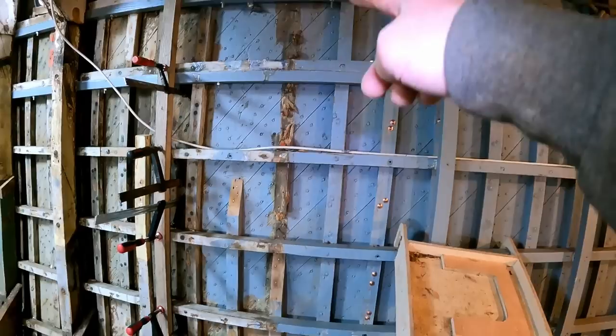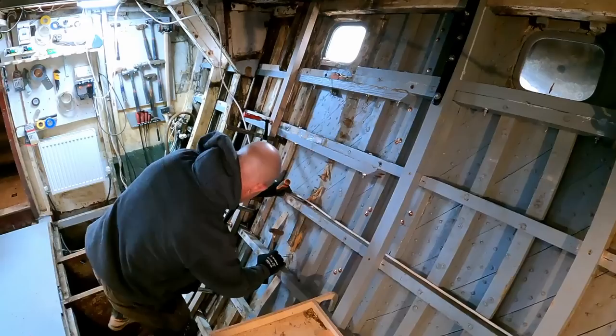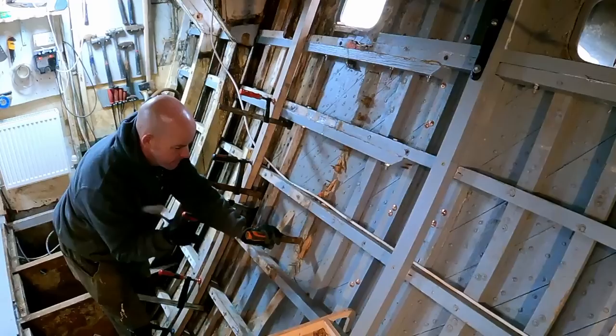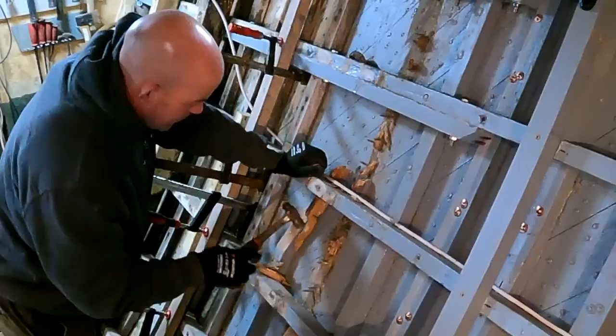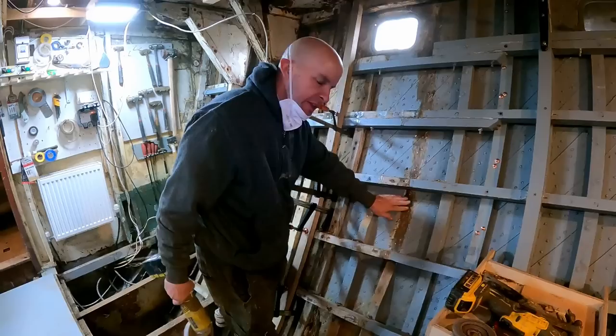Right, so now the next web frame is being steamed, we'll continue on removing the frame behind the web. So you saw me doing the scarf there. So now we'll just continue removing all of the bad. Then we can give it a paint then, can't we? Somebody's put a load of clamps in the way. So we're basically now just giving it a quick grind back because all the nails stick out, and it helps us slip it in and it'll stay snug to the hole, won't it?